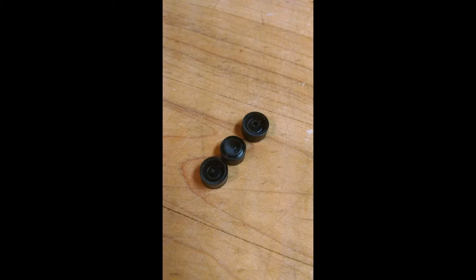The new diaphragms are made out of nylon. There are three different ones. The idea was that by making them out of nylon, they wouldn't be able to cock inside the QEV because they're obviously a lot more stiff — they can pretty much only move forward and backwards, not at an angle. I tried three different designs, all just a little bit different, and none of them worked at all. The nylon wouldn't seal against the barrel and it would always leak out of the barrel no matter the pressure, no matter if there was a hole behind it or a spring. So at that point I kind of gave up, I was just so frustrated after all this work.